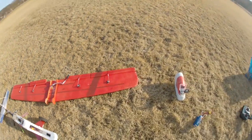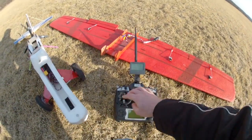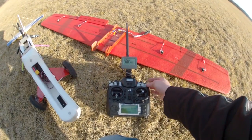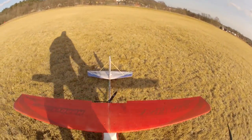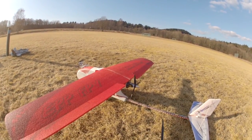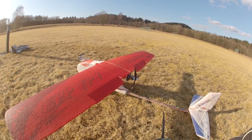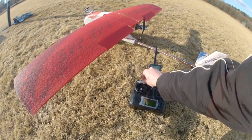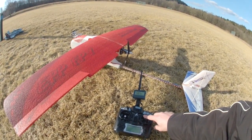To program all of this, I use my Turnigy that I reflashed with ER9X software, and I have the telemetry unit on top. For the aileron and flapperon mix — full left aileron, full right aileron, and flaps activated. I have a pot here to change the angle of the flap throw if needed, and they work in unison with the ailerons.